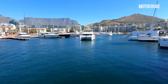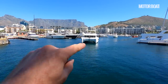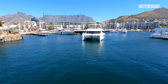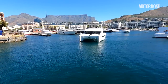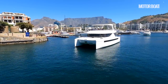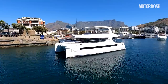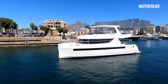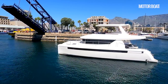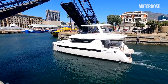If you take a close look at the design of the 46 PC, you can see that the two hulls are joined by a really full deck across the middle of them. So it's not just a narrow, flat deck — there is quite a chunky depth down there. That is to create space and volume inside that part of the hull so that you can get the beds to lie across the bow. The beds themselves lie across the boat, and the head of both beds will join in the middle in that extra volume created by that deep bridge deck. It's got those very upright stems right forward on the bow and that vertical windscreen — quite a distinctive shape. That's what creates so much volume on board and such great visibility from inside that saloon.